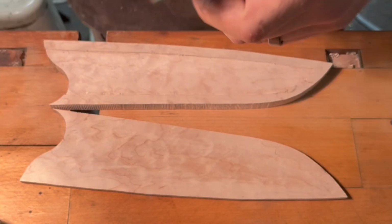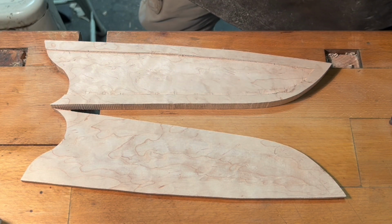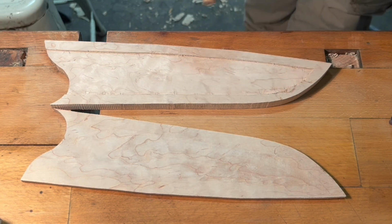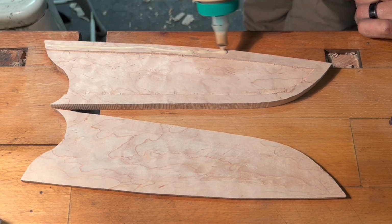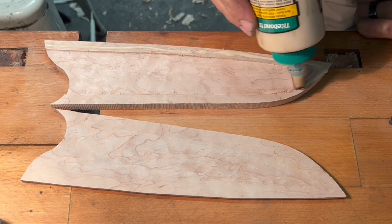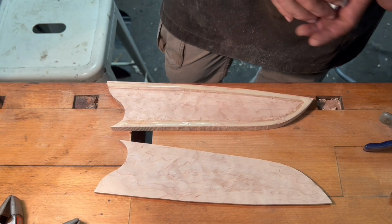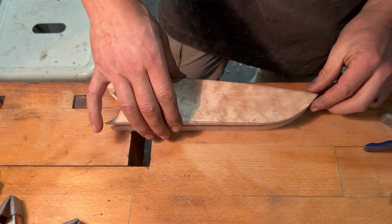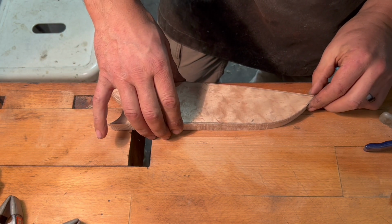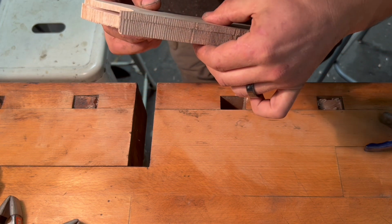I always and only use wood glue to join wood because if the joint is prepared properly, the bond is way stronger than if done with epoxy. Epoxy is a very strong resin if you need thickness or filling, but if the joints are to be invisible, there is not going to be enough glue in it to be strong, and that's where wood glue bonds much better, creating a chemical bond between the surfaces.